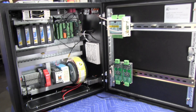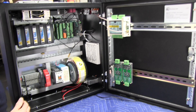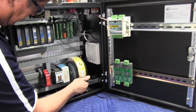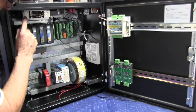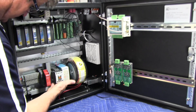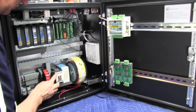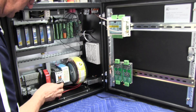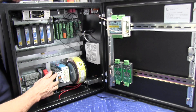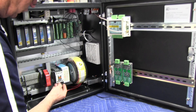Now let's have a look at how we've laid this out. I've tried to keep some semblance of order and keep different sections of wiring in different areas. The intent is that all AC wiring will run around this loop here, with some wires going up to the fan. The contactor here is a three-phase contactor but this is a single-phase device, so two of its connectors will operate the fan — turning off the noise source when the LAM Technologies drivers are not running.